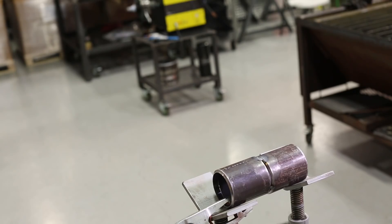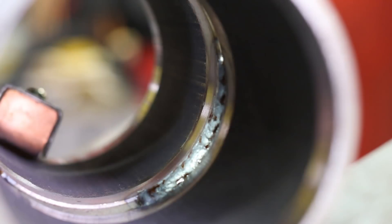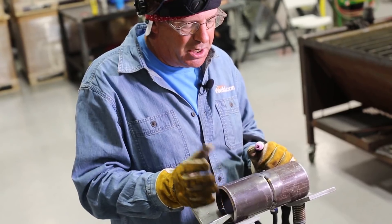Coming up on a tack, so I'm just going to blend into it a little bit, add a little bit, come on through it, and come out of it soft. That first part we shot — I was looking inside with a flashlight and it looked like it had some silicon deposit, but it wasn't bad, and it was lined up on the edge. The edge was fused — that's very important.